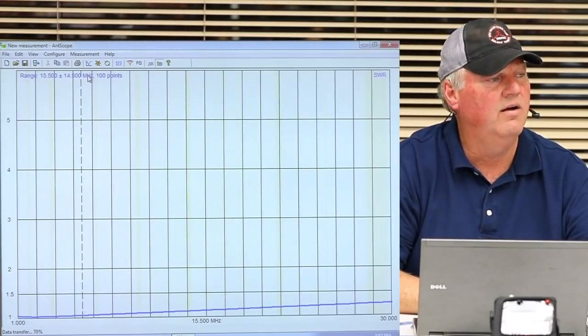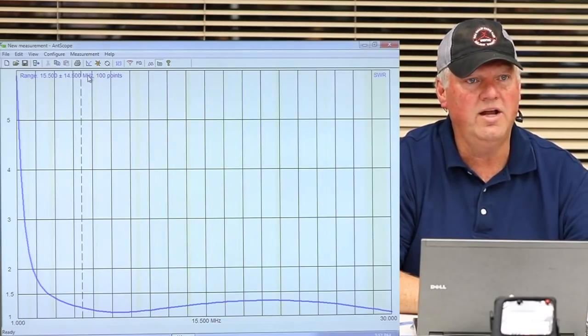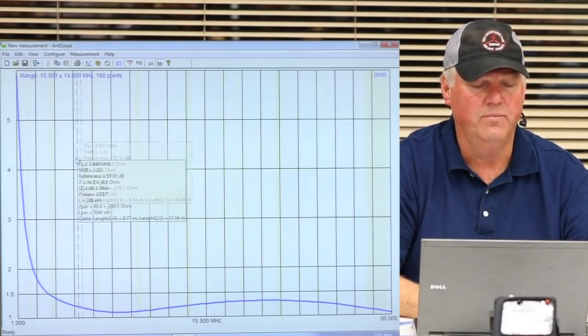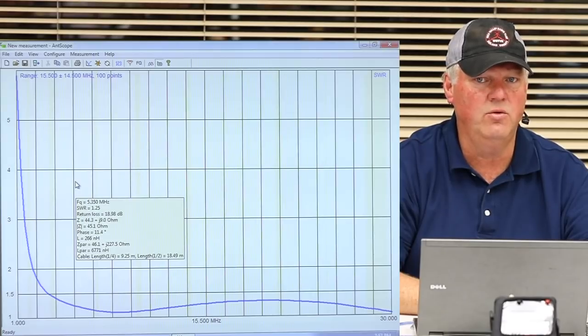What is that, 9-to-1? This is a 49-to-1. Whoa, look at that. Wow. It's different. And this is type 43 material. But what are we trying to do, guys? We're trying to just do a simple impedance match of 2-to-1, right?